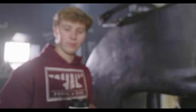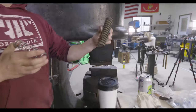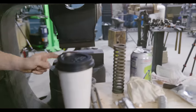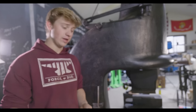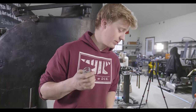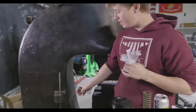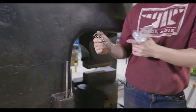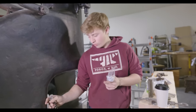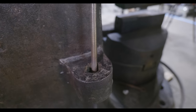All right. So next morning now, and we're gonna go ahead. I went to Ace and picked up a couple different springs. This one was a little bit hefty and made the treadling experience cumbersome, and we don't want a cumbersome treadling experience. So I bought all sorts of weird bits of hardware that we're gonna try to make this a nice, smooth operating system. We're gonna make it so that the threads of the rod aren't hitting the spring or this ear right here.